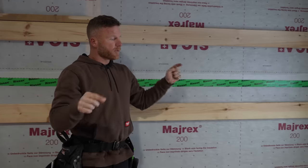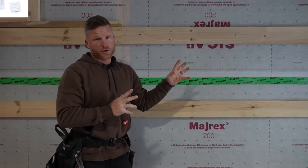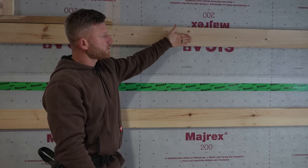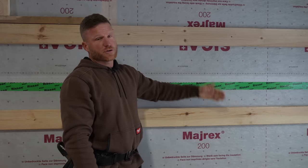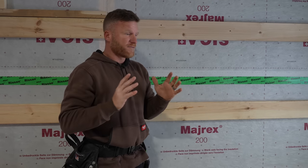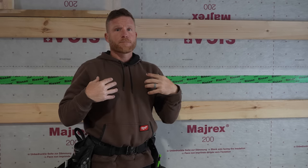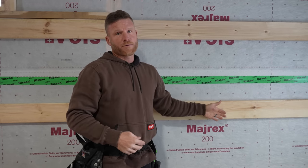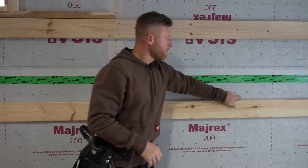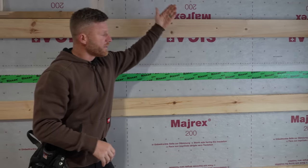Let's keep moving because we're talking about electrical. I thought that was important to note because there's a lot of confusion. We do this two by six interior girt just for added strength — you could probably do two by four, but I feel like you get one chance. You're not reframing these walls, so just put the two by six. It's marginally more money and it will be much more sturdy when this is sheet rocked.